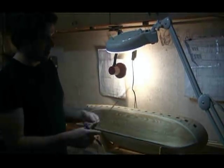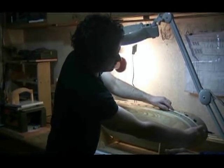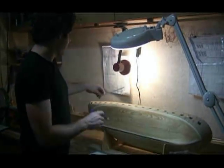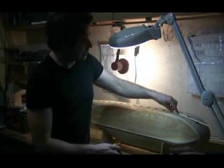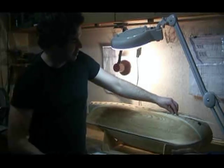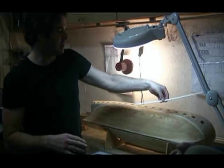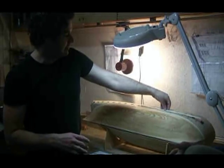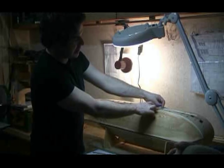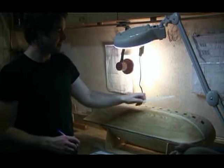When it does, he makes a long template out of plastic, which is flexible in both directions, and he attaches that with nails, only nails, no glue, to the top of that red line along the full length of the hull. Now, the reason for that is later on when you're using sandpaper, you won't actually damage the top plank. It won't take on a semicircular end because when you sand it, it'll only touch this plastic chevron template. It also gives you the capability of pushing planks perfectly up to this line without crossing it and maintaining that perfect straight line along the length of the hull.